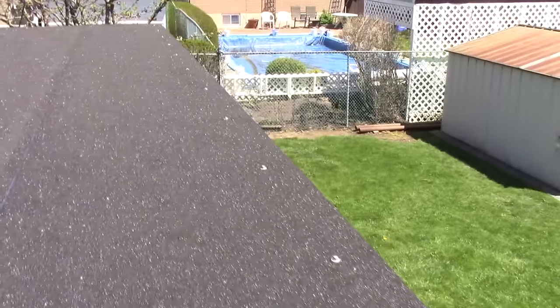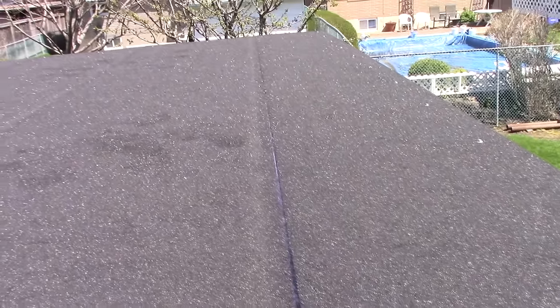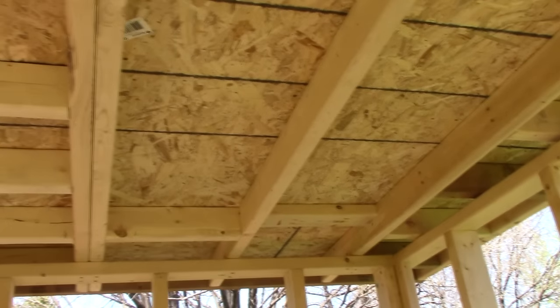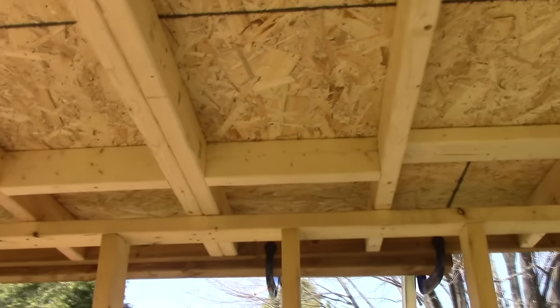It's going to settle a little while. You can see I've got roofing screws going right into the drip edge every 16 inches all the way around. Simple as that and it worked out great. The big advantage is no roofing nails — shingles aren't ideal for a low-pitch roof like this anyway. There are no holes going through the deck, and that's another major benefit.